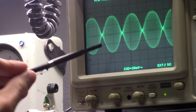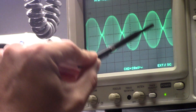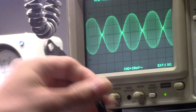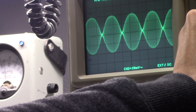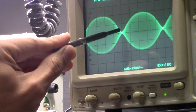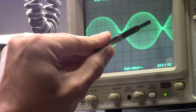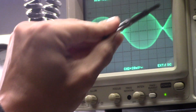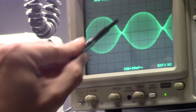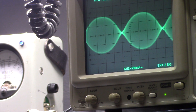With AM we get a bend here, we get a curve. So on SSB this is pointed — I can spread it out a little bit to show you better. We have a sharp point for our negatives instead of the rounded that we want on AM, and here we have our sinusoidal rounded patterns on the tops and bottom.